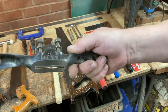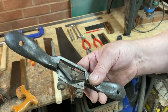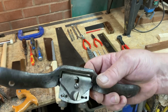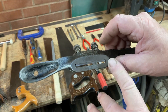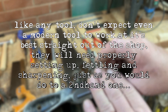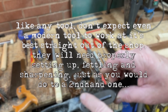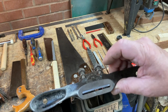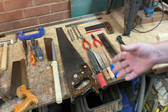This is the default 151 Stanley — we've got an Indian pattern one as well, and that is very good, it cuts just as well as this. But what I've done on this one is actually honed it on a diamond sharpening plate so that it is absolutely flat — the throat, the face — and then the blade is sharpened. That's essential: keep your tools sharp. With a modern saw you throw them away; with these you occasionally sharpen them.